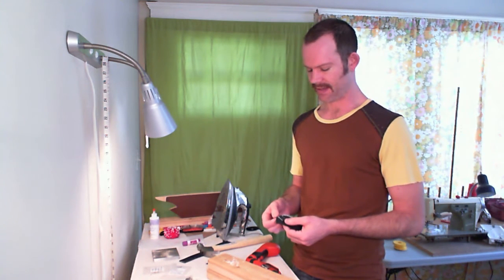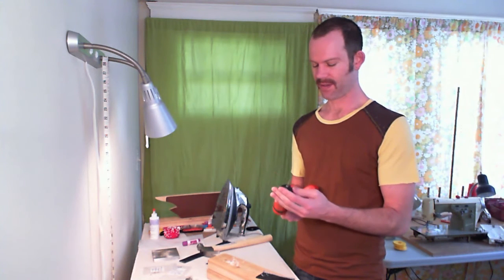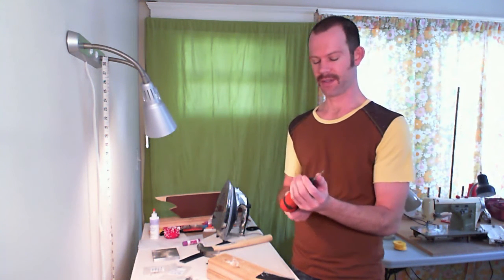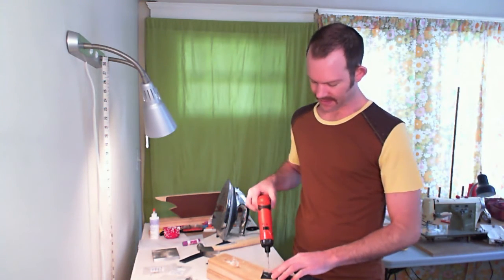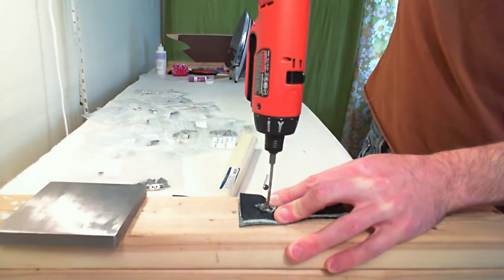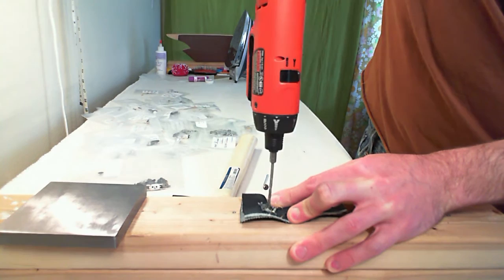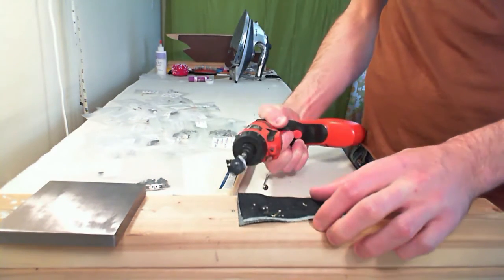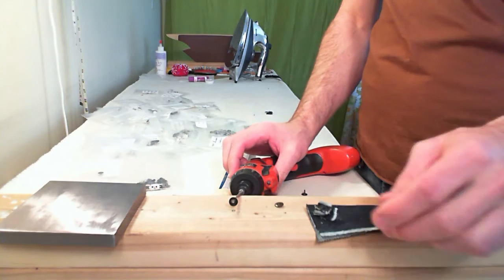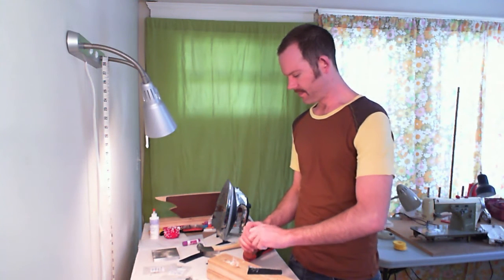The way I found you can remove rivets fairly easily is by using a drill. Use a small drill bit — this is great because you can use it right on your cordless screwdriver. From the back side, you simply drill out the center — there's a little hole there. It'll actually start to twist off, and you can tell when you've done it. Stir those little hardware pieces away, and if you just need to attach it in the same place, use the same holes and washers and attach it again.